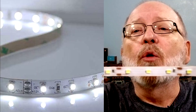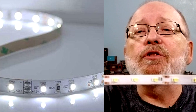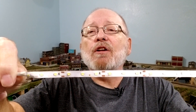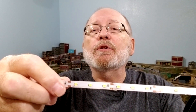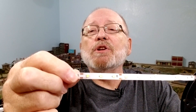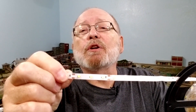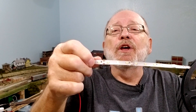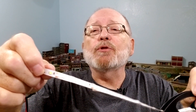The reason for that resistor is as a current limiting resistor — so you don't burn them up. Without that resistor you would just be burning these LEDs out. As you can see, what you see in a catalog or description might look a little different than what they look like here, but basically they're all the same: three LEDs with a resistor and a place to cut them off. This particular one has soldering pads which makes it easier to put leads on. Some older types didn't have those pads — you had to scrape off the coating on the tape just to solder — but this one comes with soldering pads for every three LEDs.